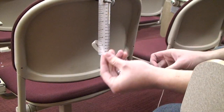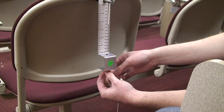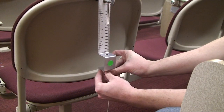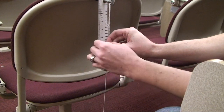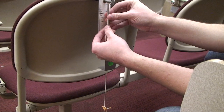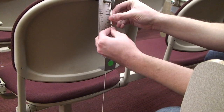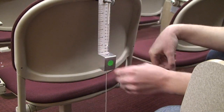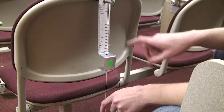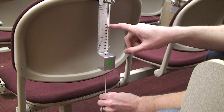Now take the loop of string and thread it through the hole from the bottom. Then attach the hook to the bottom loop of the spring. You'll also want to make sure the spring is aligned such that the string will go straight down through the tube. If the bag hangs too close to the ground, make another loop or knot in the string a little higher up and just hang it from that. It'll take a few marbles to overcome the initial tension in the spring, but be sure to write down exactly how many.